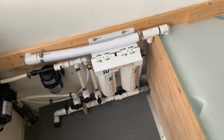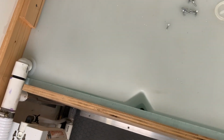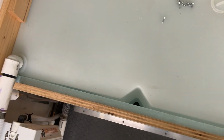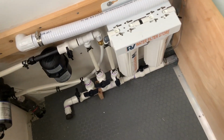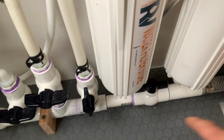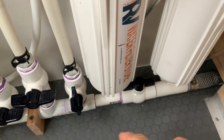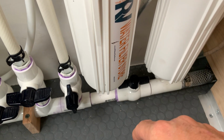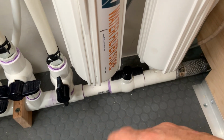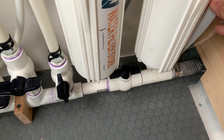We're filling up the water tank. It's going pretty quick. We're maybe a third of a tank, and it's only been about 15 minutes. I shut the valve off so there was no flow, and the pressure regulator underneath the floor was holding pressure constant at 40 psi according to the gauge that's on it, which is okay. I could jack that up to about 50 probably, and it would fill up a little bit quicker.